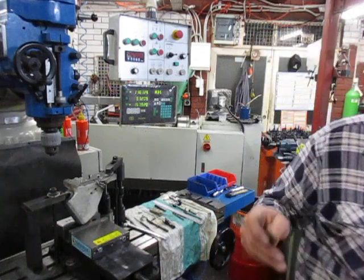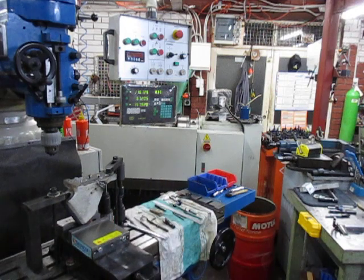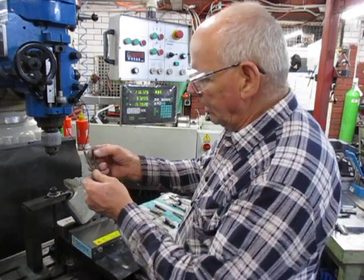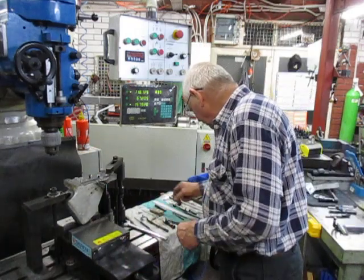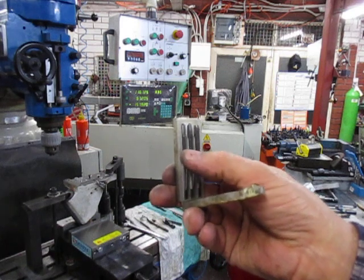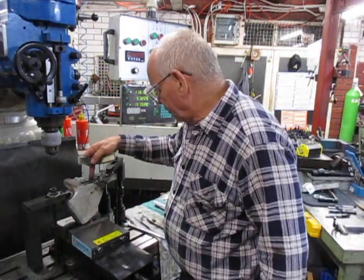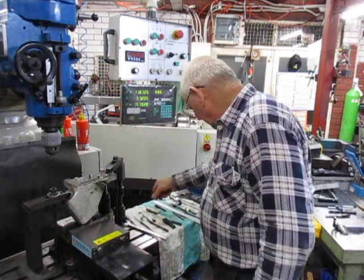Where we've got a through hole, we've used the machine gun tap, and where we've got a blind hole, we've used the spiral flute tap. Now, where we have to go in quite deep, the shoulder or the back of these taps is much bigger than that, so I couldn't get down the depth. So I pulled out an old set, and I hate tungsten, but this was a set of tungsten taps, and the actual shank is smaller than the hole. So that allowed me to tap deeper in for these areas where I'm connecting up.